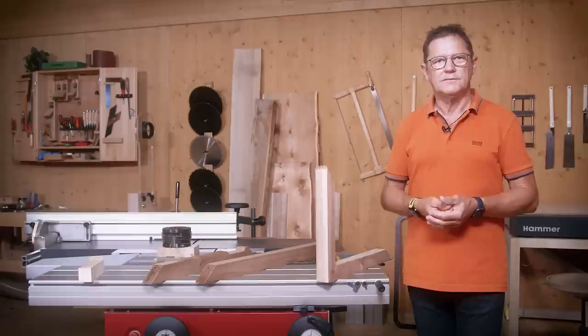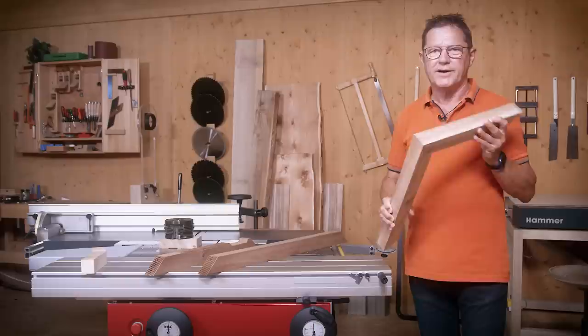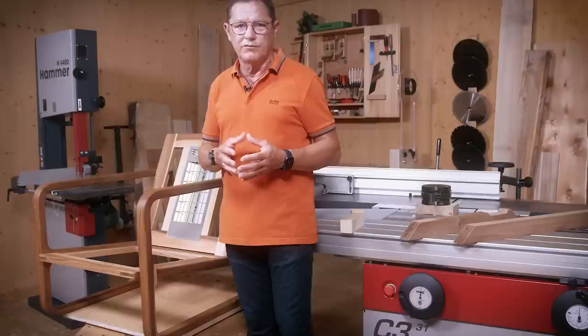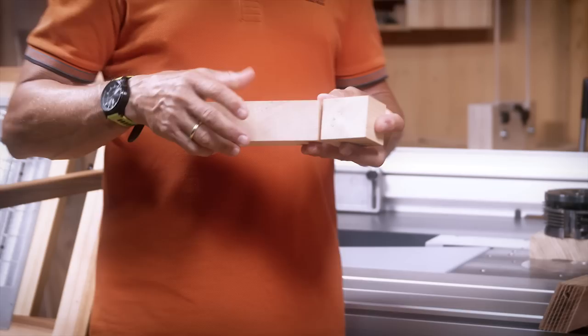The next step is particularly important because it is what makes our chair design possible in the first place. The magic word is finger joints. A strong and elegant connection at particularly critical joints. Inspired by the tubular steel classics such as the Bauhaus furniture by Marcel Breuer, we create these tubular curves in wood as well. If you were to work with dowel connections in solid wood, such a construction would be much too weak. With finger joints, however, the gluing area increases by a factor of 3.5.